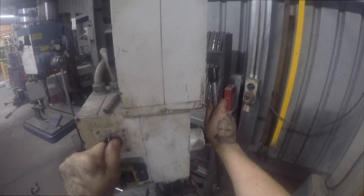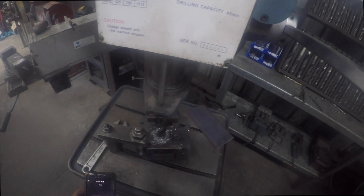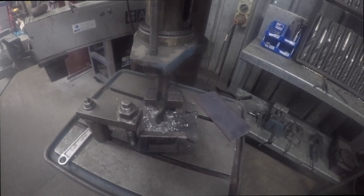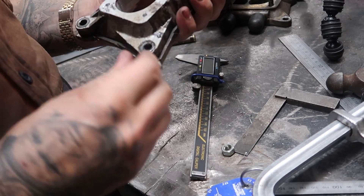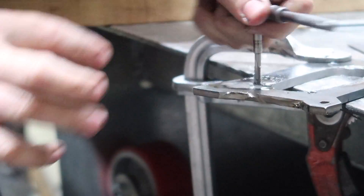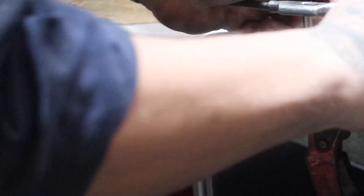The next plate we need to make is a steel plate that welds to the manifold and bolts to the alloy adapter. I've chosen 6mm plate so I can get a good amount of thread to tap into it and so I can weld it without bowing or giving way. Basically make it the same overall size as the alloy adapter so you can bolt it together, drill the holes the same size so that matches up too. I've decided to drill two holes and use the oxy cutter to cut out the excess and make it an oval shape. Bolt it all together, run pilot holes through the alloy adapter, then tap those holes, clean up all the edges, and get ready to weld it to your manifold.